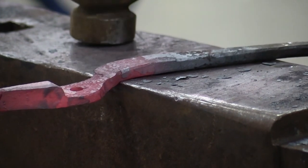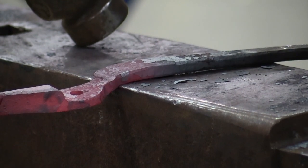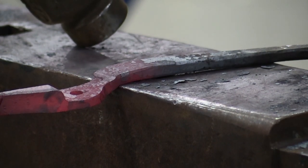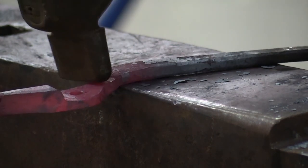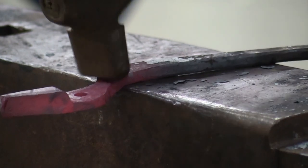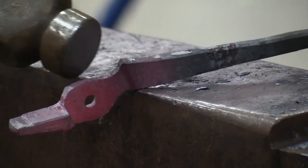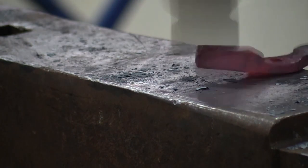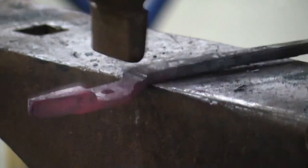It's not a lot, because you've got to think these tongs are about a quarter inch thick. It only needs to be like 3/16 to an eighth of an inch to be able to stack on top of each other. It just has to be half of the distance. It's just with inertia, things happen. When he hits it here, it goes up here, tells him to come back. When he does that, it puts a whip inside this boss. So I'm going to hit that jaw, get that whip going, have him hit it again, and it'll bring the whip flat.